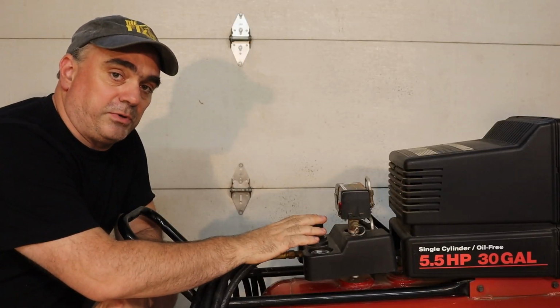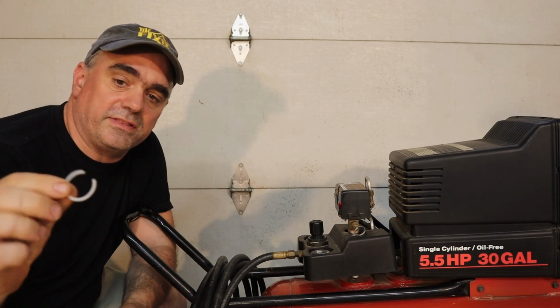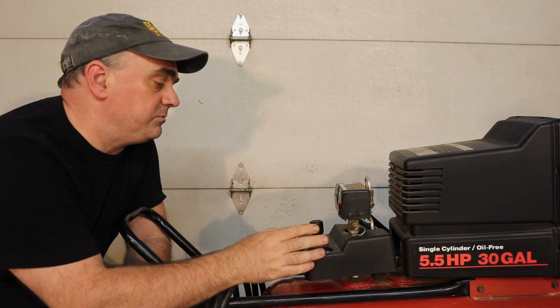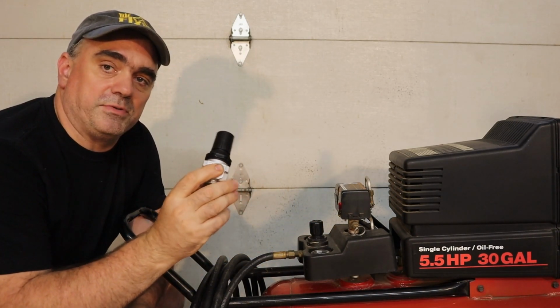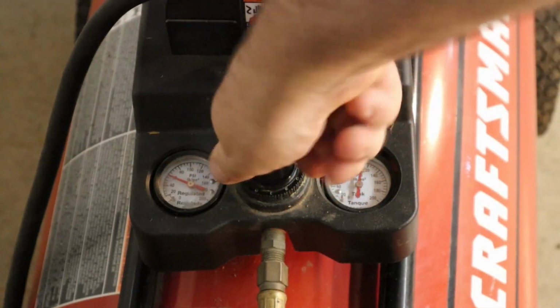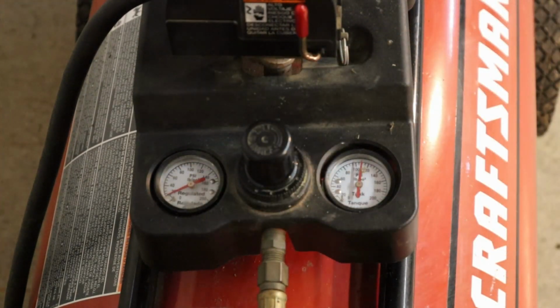So I did try to fix this pressure relief valve. As you can see, I found this ring that was inside of it that was broken, and I believe that's where the leak was coming from. I tried to seal it with some gasket maker. That didn't seem to work. So for 20 bucks, you can buy these on Amazon, and I will put a link to that in the description. I'm just going to replace it. All right, so if I turn it back down, the hissing stops, so it's coming out of the regulator.